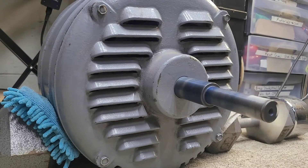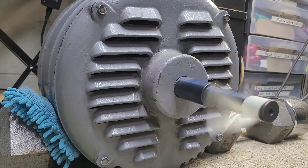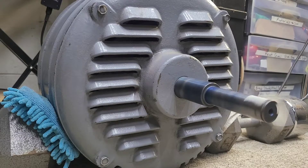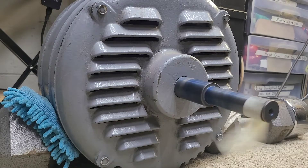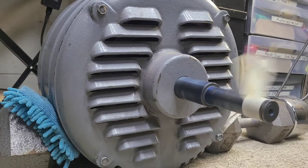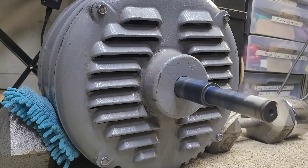The first time I hadn't done any capacitor adjusting on the converter and it was off by about 35 volts, which was too much. Now it's running nicely. The whole converter and this motor running right now is drawing 2.2 amps at 247 volts — that's the single phase draw coming out of the wall. I'm getting around 2.6 to 2.7 amps between each of the phases. I have this pretty well power factor corrected, so when the converter is just idling it's practically drawing no current through the line.